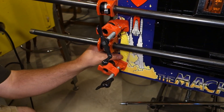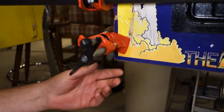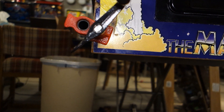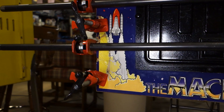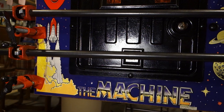I'm pretty happy with the bottom corner here. It's still got a little gap — we're going to fill it in with some wood putty — but it's all pulled back together. We're also going to take out the inside block and replace it with a new one to reinforce the corner like it's supposed to be. We'll show you what it looks like when it's dry in a couple of days.